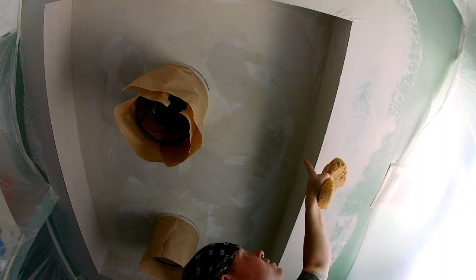Look at that. Nice clean edge here, your square edge, and just keep it shiny. Everybody thinks mud needs to be on that edge, but no, it needs to be nice and square, 90 degree metal edge showing. Nice sharp, clean, sharp edge. Go around, feather your edges, most important. The bottom area looked rough, but it looks better than up there now.